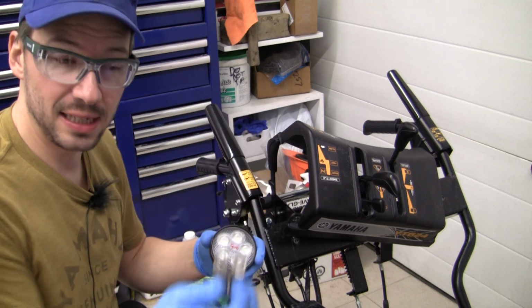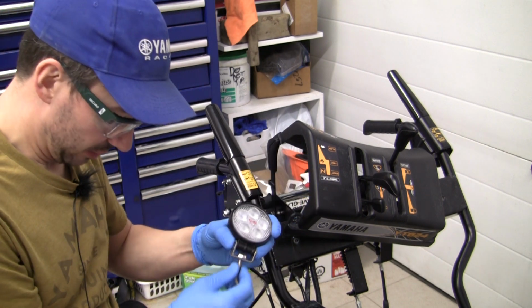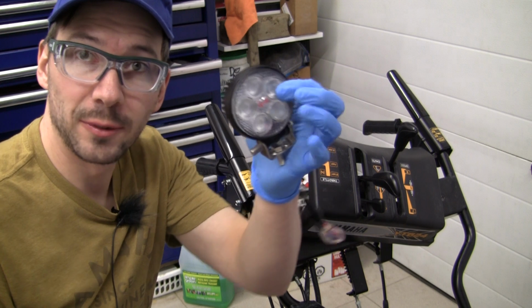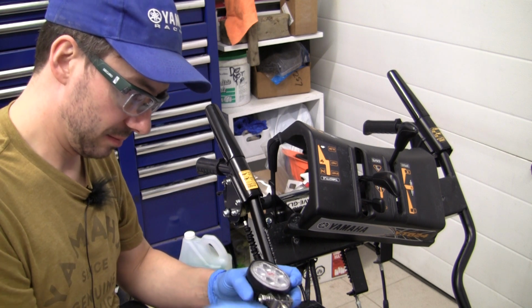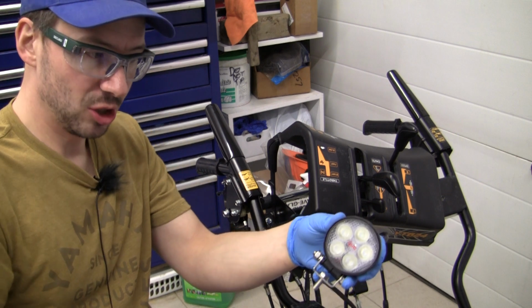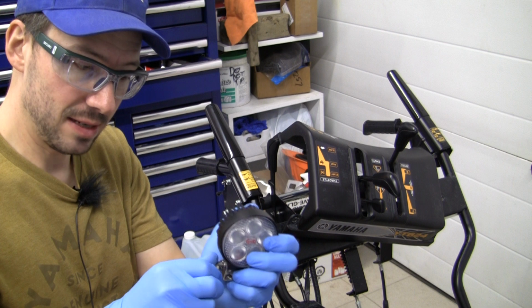So we then take the light with the bracket and the bolt, the small bolt that came with it. We assemble this. We put the bolt on the side where the bracket is dimpled. After putting the long bolt through, we are going to apply a little bit of blue Loctite. Then we can put the lock washer, we can put the nut. So for myself, I'm going to put the light with the bracket facing exactly down, maybe adjust it later. We're going to apply the lock washer and then the nut.